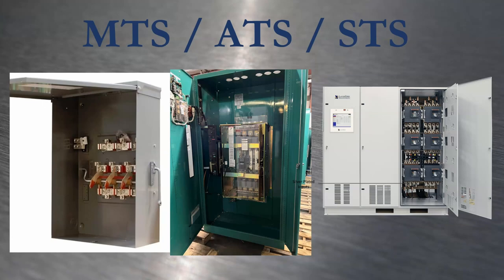So what if the thing you're powering is intolerant of even a momentary loss of power, like a large server rack at a data center? Enter the STS, or static transfer switch. They're used when you have two permanent sources of power, such as a utility and an always-on UPS that turns stored battery energy into AC power. They use IGBTs, TRIACs, or other transistor-based power components to switch incredibly fast with no moving parts. Due to the complexity, they're much more expensive and find fewer niches in application — typically only at data centers or powering a single server rack.